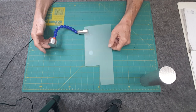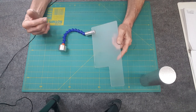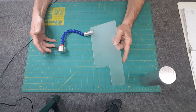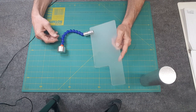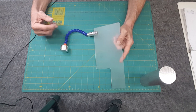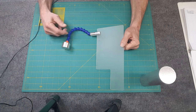I still obviously need to get the right plastic and play with the size, but Lockline, I've always looked for the tool to take these apart and put them together, and every place you look, Amazon, wherever, they say it does take them apart and put them together. For the heck of it, I went on YouTube and found a video made by Lockline, the manufacturer, and they clearly tell you that the tool that everybody has only puts these things together. It does not take them apart, and it's a pain getting them apart. But he showed you stick a screwdriver or something in there and you can bend it enough that it just pops out. I'm not going to buy the tool because it's pretty easy to put them together.